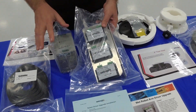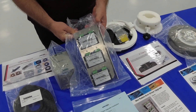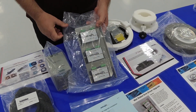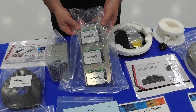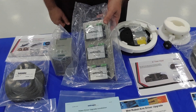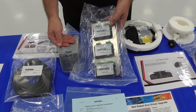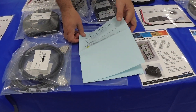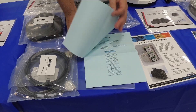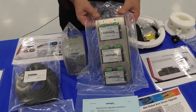This next upgrade is our wet robot driver upgrade assembly. This is a plug and play — this bracket will fit in the place of the original OEM bracket, allowing you to change all three drivers at the same time. The upgrade includes a power supply and clean room installation instructions. It is a fairly simple upgrade; the wiring only requires removal of a jumper and uses the existing cabling.